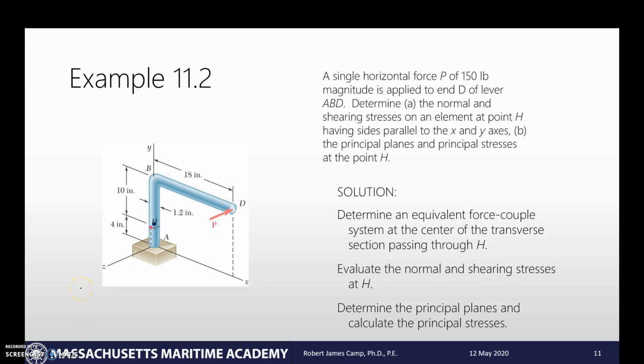If I'm doing a free body diagram of this, I'm going to have some force that opposes that P, because that's what's going to balance out. There's my sum of forces in the Z direction. But then I've also got this thing that's wanting to spin around this way, so that means it's putting a torque on this. If we move this P value over here, it's putting a torque right along this, so it's torquing around that system. But because we have a difference of space to move this P value from here to here, there's also going to be a moment that's going to be resisting everything.